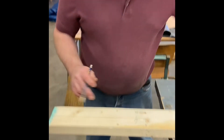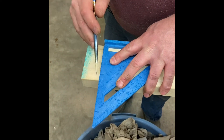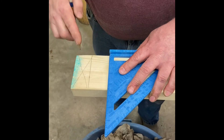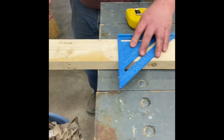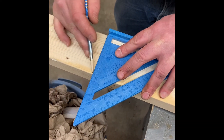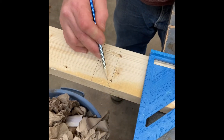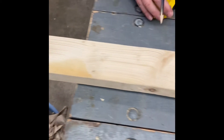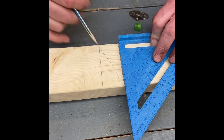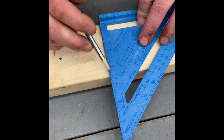Now that we've got this marked, I'll come back with my framing square or roofing square and scribe a line. This is where our stud is — we'll mark that stud with an X. Going down to my next marks, we clearly identify where each stud is going to go on this bottom plate, making it easier when we frame.